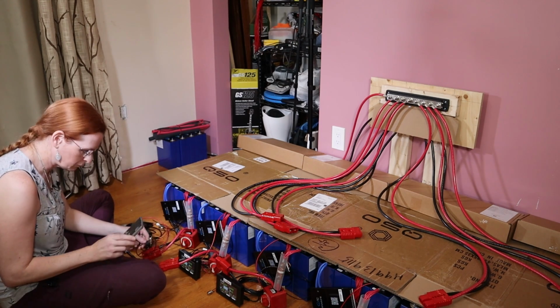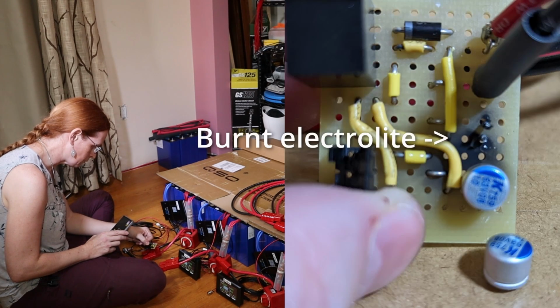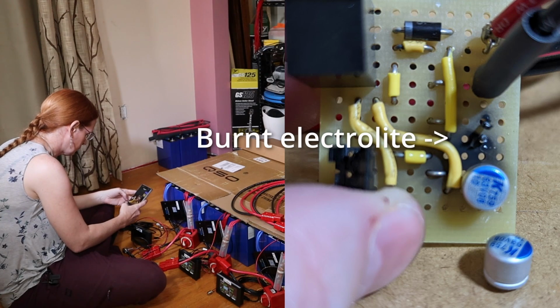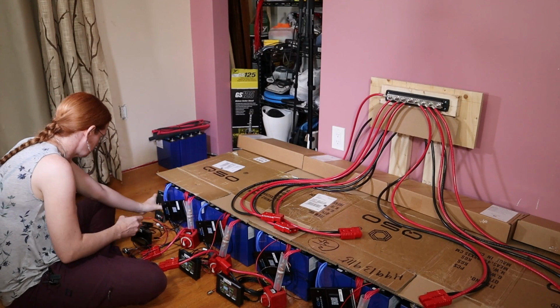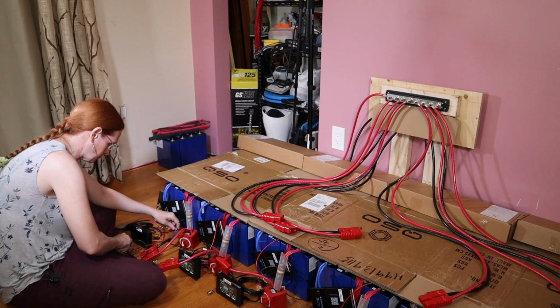Either it's reverse polarity or it's over voltage. Those are really the only two options for a new capacitor like that. And it would have shorted out, which is why your screen would have gone off. All the energy going in there is what caused it to grow, because the electrolyte gassed out and created pressure inside. Like it deformed the metal. There's serious pressure in there, right? That's probably the bang I heard then, was the canister pressure relief failing.